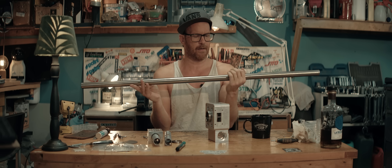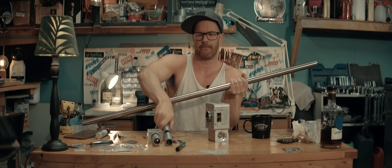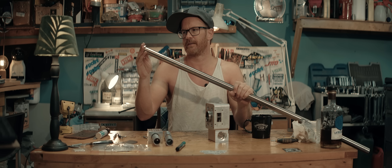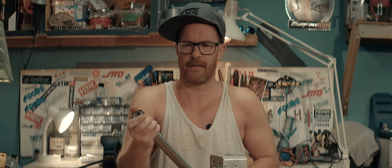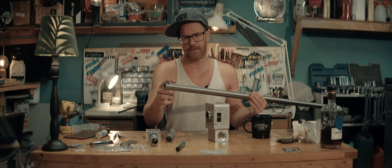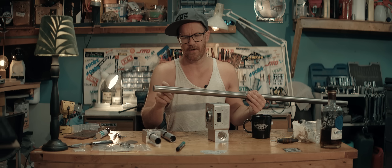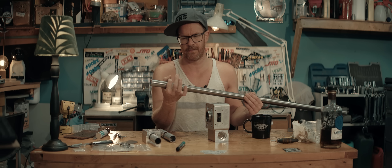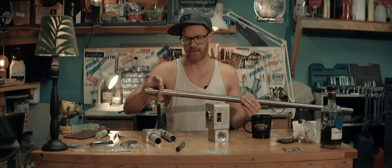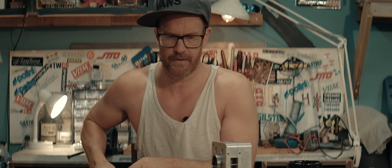This time I got hold of some stainless hydraulic pipe. This is nicer — better finish and a better fit on the bearings, a really nice snug fit. I'm hoping the pulleys will arrive today. I need to cut up this pipe, press on the pulleys and probably weld them, machine the cutouts, then mark out and cut grooves for snap rings — or seger rings, I'm not quite sure what they're called — those spring clips which hold things in place. That's the order of operations.